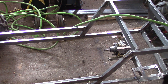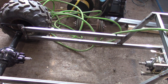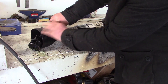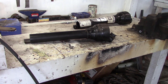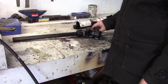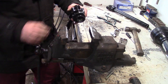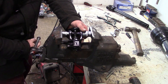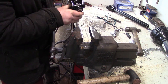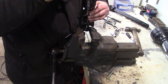We need to join these two bits together, the axle and the gearbox, and we're going to start off with a tiny little tractor PTO shaft. The first thing was fighting past this plastic shroud on it — nice tough bit of plastic. Then the fight with the circlips, and the UJ came apart pretty easy, which you'd expect because it was brand new.